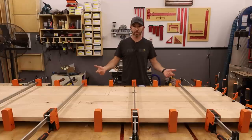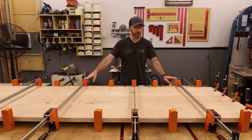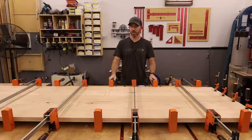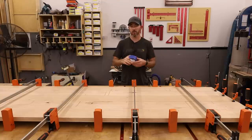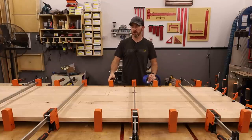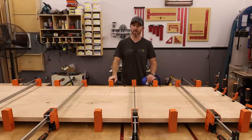All right, it's a couple days later. We're back out in the shop. I'm gonna get this out of the clamps, but not all the clamps, just the ones on the top and the ones on the ends, because I'm gonna stand it up or flip it over and tape off the backside where there's knots or cracks or holes or anything. And I'm gonna flip it back over and then fill those with epoxy, let those cure overnight,